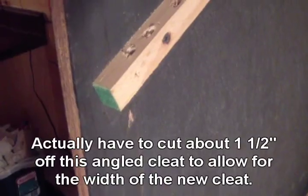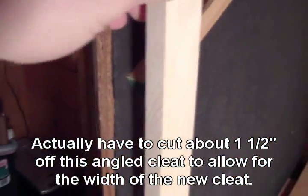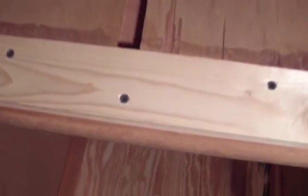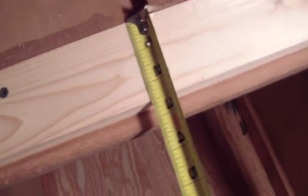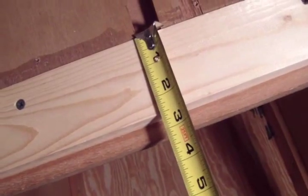And we're also going to have to chop about 1/4 inch or so off of these that come down at an angle supporting that speaker panel. But once we do, these will fit right in place on each side, and they'll leave a 3/4 inch reveal. I made these cleats out of a piece of board like that right there. I think that's a 1x3, if I'm not mistaken. So it's like 3/4 inch by 2.5, about 2.5 inch wide and about 3/4 inch thick.